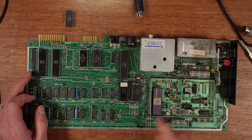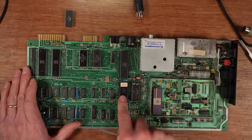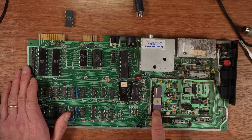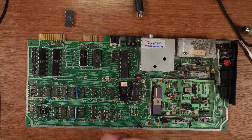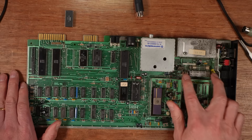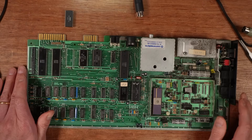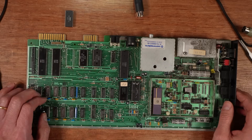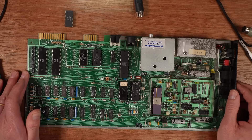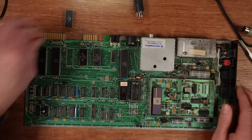What do you think it is? Can you help me? Before I edit this video I will double-check all of the socketed chips in a working machine — the PLA, the CPU, that ROM, and the VIC-2. I'll clean the sockets. Something else I did off camera was check all of the caps with an ESR meter, and all of them are pretty much within spec. There are a couple with only a couple of ohms of resistance, but everything else is in very good condition. Voltages are all good. I've checked the clock. I've checked the reset.